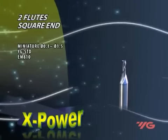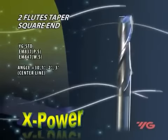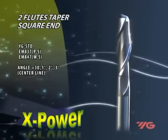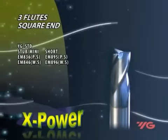Applicable for traditional or high-speed cutting methods, tools are suitable for dry machining on steels. The titanium aluminum nitride monolayer coatings combine high hardness with high thermal stability against oxidation, reducing coefficient of friction against steel with higher cutting feeds and speeds.